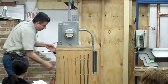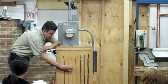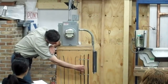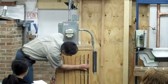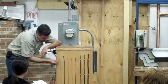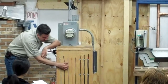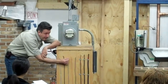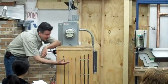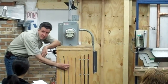And the wires are sized in different gauges. This right here is a 14 gauge wire. Thicker, it gets lower. This is a 12, 10, 8. This right over here is a 3. And this should be a 1, and it is. These right here, if you see these open in the basement area, this is just low voltage cable. But with this wiring, if I'm putting a 20 amp fuse or breaker on this wire, it's allowed to heat up to a greater temperature before it could trip that 20. Each time you do that, it can slowly deteriorate the wire.